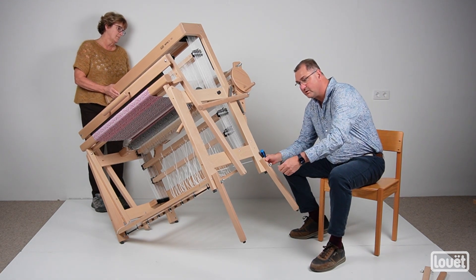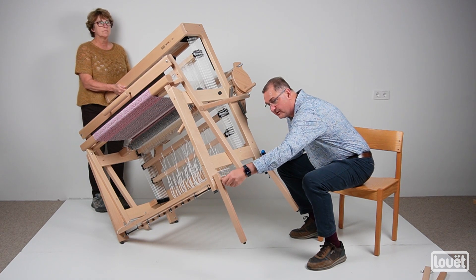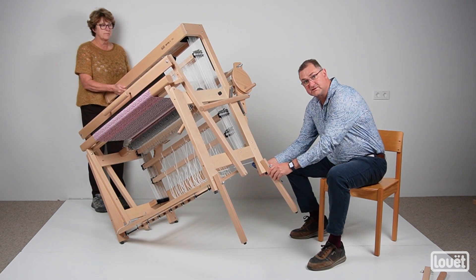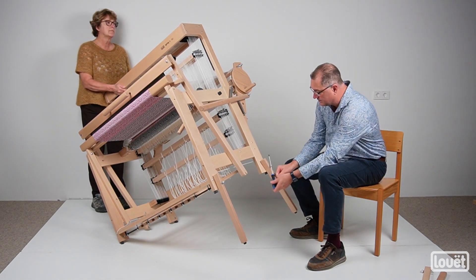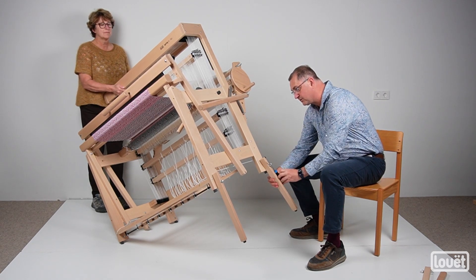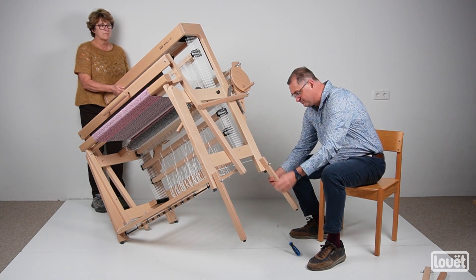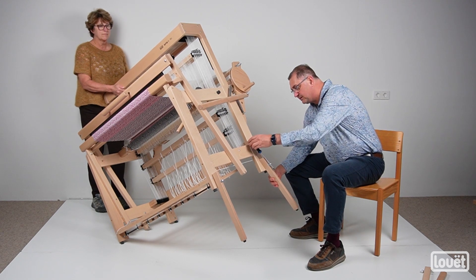With this one here, the nut is already inserted and grabbing on, so with one hand I can make it nice and snug — it's solid now. For this other one, the nut is still sticking out, so the first time you'll need a screwdriver to tighten it. You'll feel quite a bit of resistance as you're pulling that nut into the wood, but that's a first-time assembly issue only.